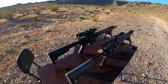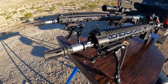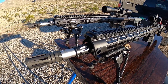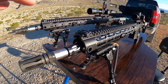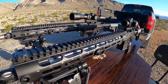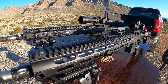Seeing how both rifles are identical, I'll just go over one of them. Wilson Combat Tactical Hunter 18-inch barrel, 11 and a quarter twist rate, stainless. A Rifle Speed gas block using the shortest plunger at .898. The barrel originally came drilled for 88 thousandths and I drilled the gas port larger to 92 thousandths. The gas tube is Armalite spec or DPMS. I was able to use 15.5 inches on the gas tube — one rifle has 15.4, the second build used 15.5 with no interference issues on the gas key on the bolt carrier group. Rifle Speed uses a straight gas tube with no bends.